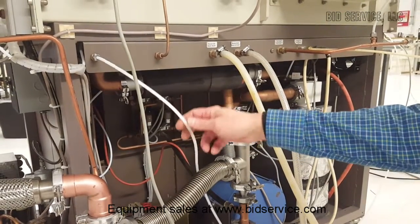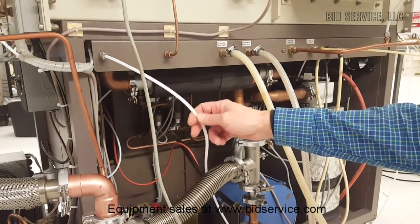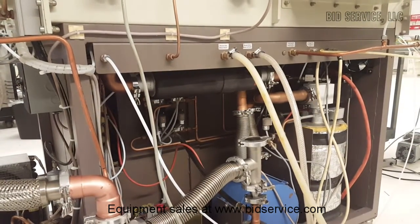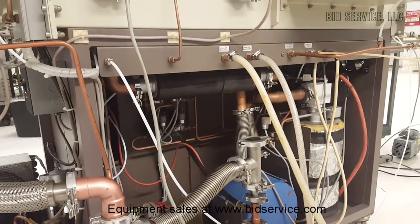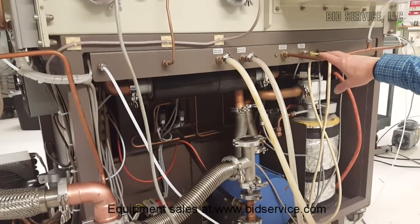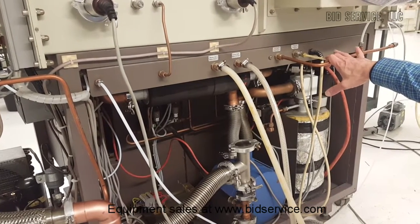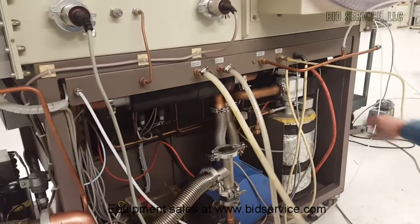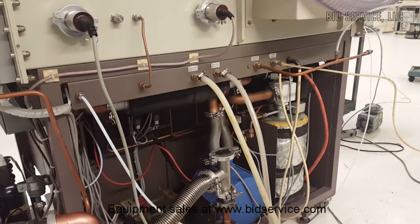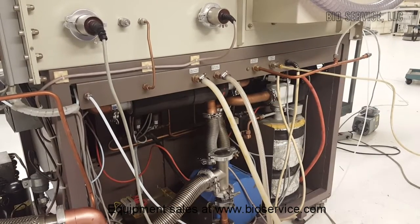While we're back here, here's our outlet — we're monitoring our O2 using the Delta F O2 analyzer. The gas is being pulled through this line through our analyzer, being sampled at about 1 liter per minute. We have a connection here for a regeneration gas, and this only needs to be in place just prior to starting your regen. And then here we have our working gas, which is our nitrogen. This is used to open the valves here — any valve that is pneumatically operated is going to need about 80 to 90 PSI on that. It's also used to purge the box and add nitrogen to the inside of the box.